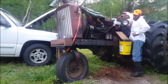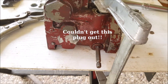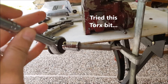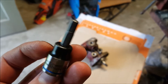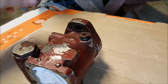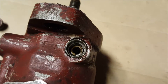Bonjour mes amis, this is Servi Homestead. Here's the final part of the Bosch injection pump disassembly. I could not get this plug out — this is for the release relief valve. I tried a few different bits that fit in there and finally bought a kit of metric allen wrenches that fit on a regular socket. I had to heat it up with a suggestion from my uncle, and it finally came off. It's just a plug with an o-ring on it. There's a spring in there that I removed with my homemade pick tool.